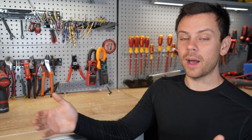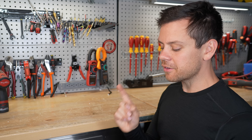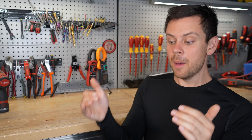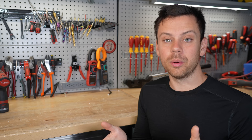The best way to know if you have an imbalance is not to look at cell voltages — do a capacity test on your whole battery bank. If you pull full capacity, let it be; it will balance on its own. If you do have a severe imbalance reducing capacity, just charge to 100%, pop the top off the battery, charge each individual cell to 100%, and put the cover back on. It only takes a few hours and you'll have no risks of an active balancer on your system. One valid use case is in very cold climates where batteries don't have enough sunshine to stay at 100% long enough to balance. For those people, you can charge to 100%, balance it quickly, and it will be good for most of the winter. But again, you're creating a new fault point.